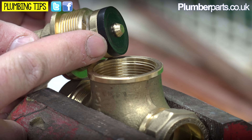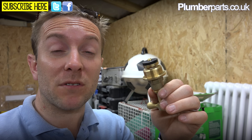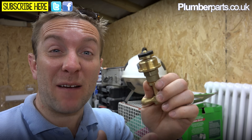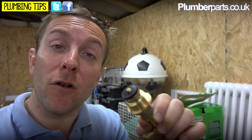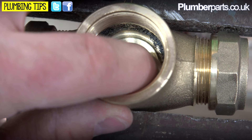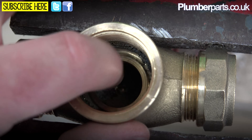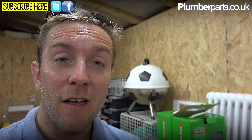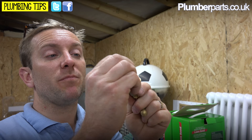I'd always recommend trying to replace the fiber washer. This bit here is super important - this is a rubber washer. When someone messaged us saying their stopcock wouldn't turn off the water, the first problem you're probably going to find is that this rubber washer has basically fallen apart and is letting water through - it's not creating a watertight seal onto the metal seat. If you look from above, the rubber washer presses down on this little flat metal seat. If that's got any nicks in it, you'll need to use a tap reseating tool to grind out the brass and make it flat again. I did a video about how to reseat taps - I'll leave a link in the description below.